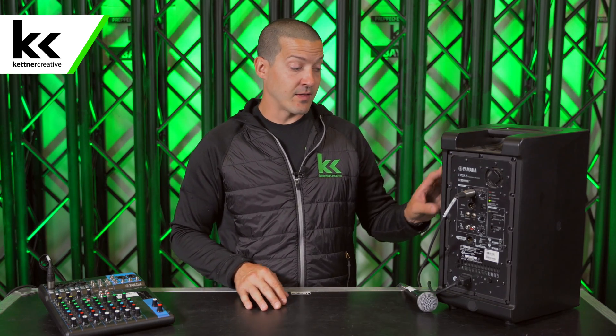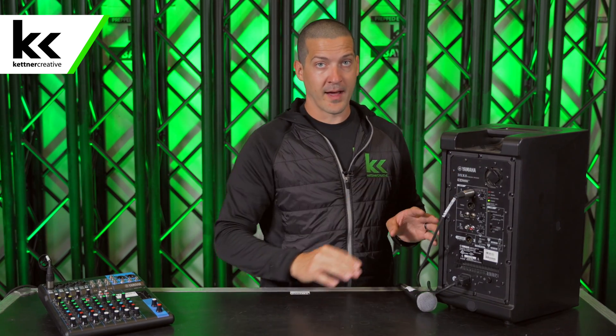Two, there's only one microphone input on the back of the speaker. Maybe you have a set of speeches, and sometimes it's really nice to have two microphones — you can't do that in this situation. You really need a mixer like this that has, say, four microphone inputs. You can plug in four different microphones, adjust the volumes, apply a high-pass filter to make sure they all sound a little nicer and more crisp, so you're not passing microphones back and forth all the time.